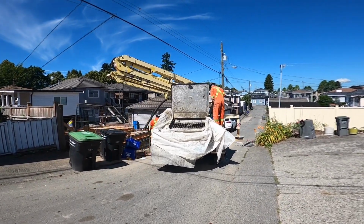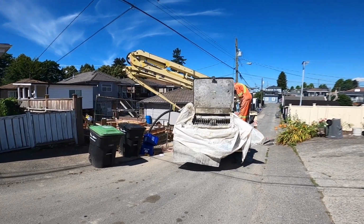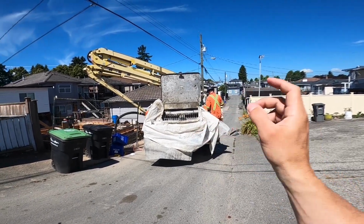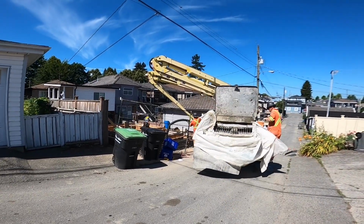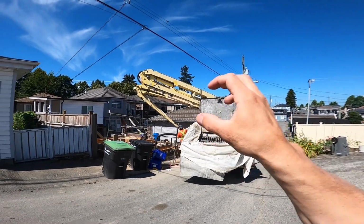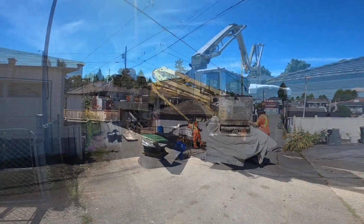Don't like doing that. You end up with a hopper that's an absolute mess at the end of the day. And as I pointed out before, baking hot concrete in the hopper, taking one stroke and moving it 10 feet down the pipeline, doesn't really achieve a whole lot. It's still baking hot concrete sitting in your boom pipe. So not a fan of that.